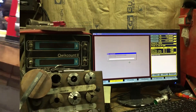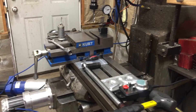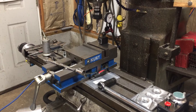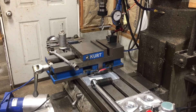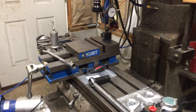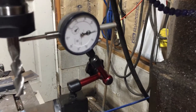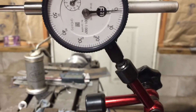After we cut the spindle, a little later we decided to do a quick runout check again to see how much better it was. We were at six and a half thousandths before I cut the face of the spindle with the TTS system. I went ahead and chucked the same tool we had in, torqued it back down with the normal three-quarter-inch wrench to about the same as I've always used. With it drawn back up to the mill now, with the true face cut to the table, here's the dial indicator running at around 50 RPM on the spindle.